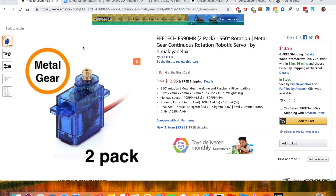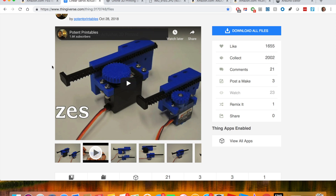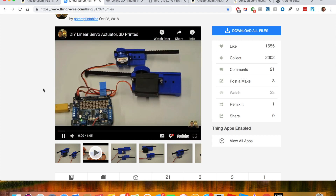Here's a little more info on some of the items I used. First, I used this small servo — it's the FS90MR, and that's only $14 on Amazon. Next, here are the 3D plans I found on Thingiverse on how to print this: the files to print the pinion gear, the bracket, and this little pusher rod. Here's a quick view of how it goes in and out. I did the smaller version, so down in the files when you download the STLs, it's the one that says Mini.